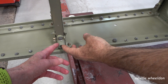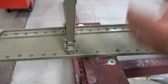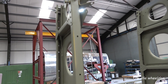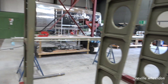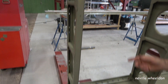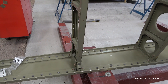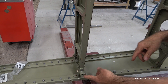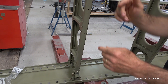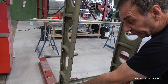These are the lifting points — where you screw an eye bolt in, and they're flush with the skin. The two on rib six and the two on rib 22 form a big box structure at the end. You're supposed to have a spreader bar on it, but ours has been lifted without a spreader bar, so those two bits are actually bent inwards quite severely. I guarantee this is no good.